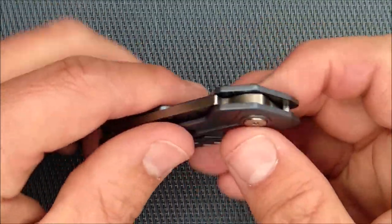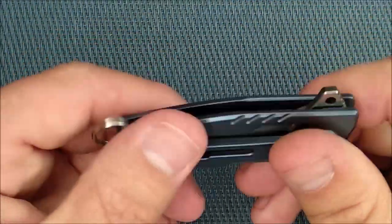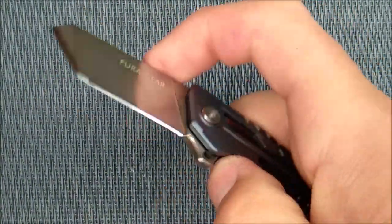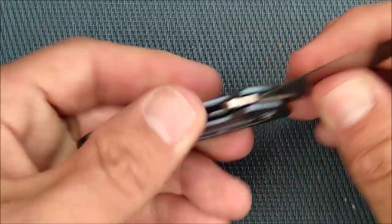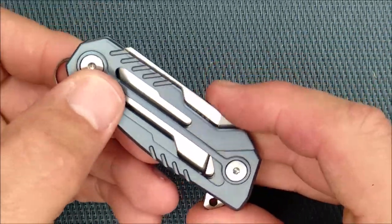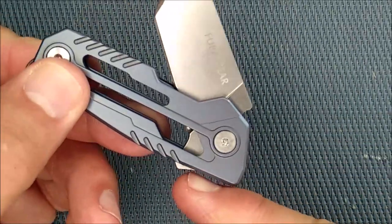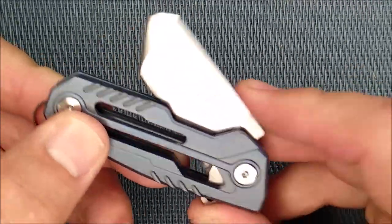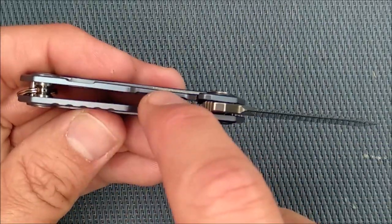So I think that the pivot's really good. No blade play side to side, up and down. Really, really good that way. And the detent is good enough that it's easy to open the knife and have it flip all the way open. No problems. I did carry it on my keychain for a couple of days, and I never had it open up. But I guess something could theoretically tap on the end here and have it come open while it's on your keychain. So what I am going to do is respring this arm here, the frame lock arm,